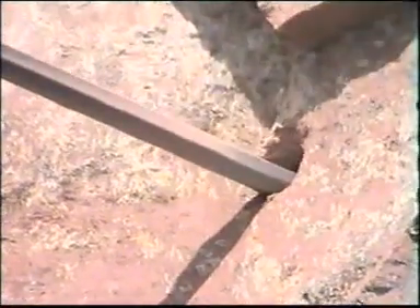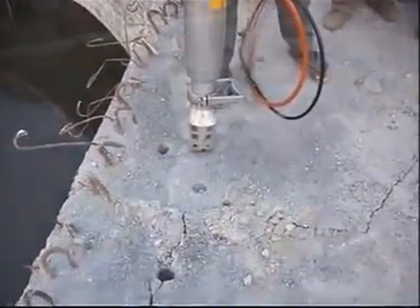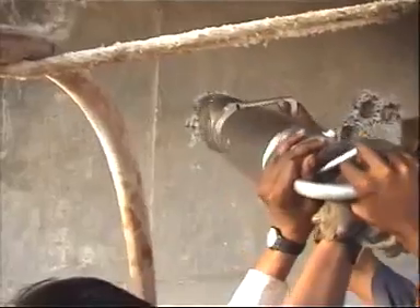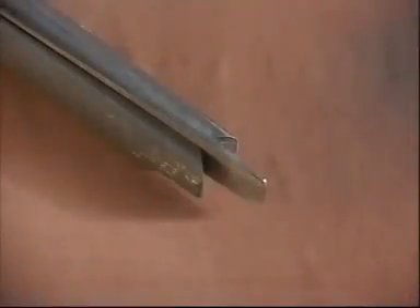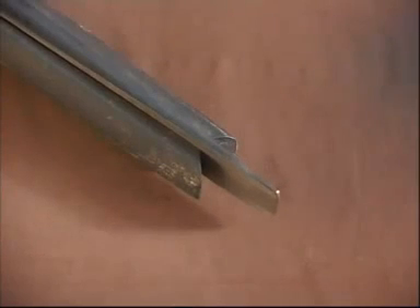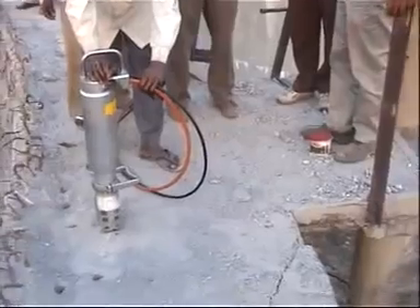The primary operation while using a hydraulic splitter is drilling, and it is easier than the conventional method of pneumatic breaking with a compressor and jackhammer. After the drilling operation, the splitter wedges are inserted in the hole. The hydraulic pressure pushes the center wedge forward, forcing the two counter wedges to move outwards, exerting a pressure of 415 tons and splitting the material within seconds.